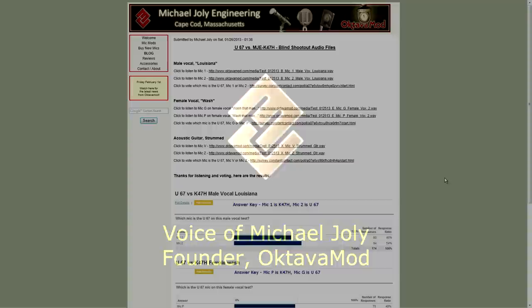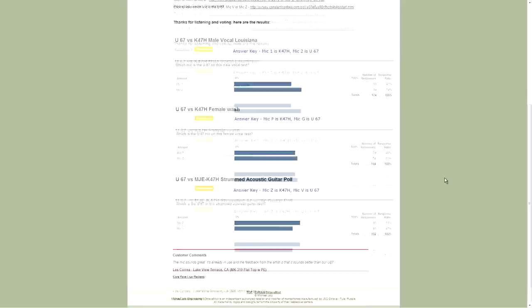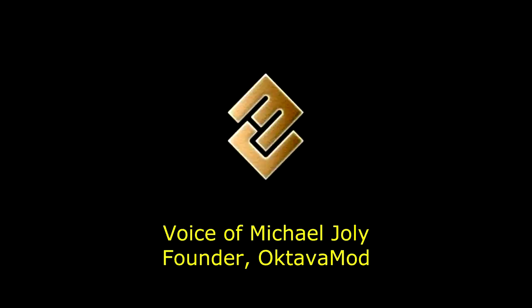So this K47H was sort of an accidental emulation of the U67 sound — without a tube though. I've got samples on a blog page on my site comparing the K47H with the U67. On first listen the overall timbre balance of the two mics is quite similar. But if you focus on dynamics, you can hear the U67 has a bit of compression going on — a combination of the tube, transformer, and negative feedback circuit. The U67 sounds a bit more processed, more radio-ready right out of the mic. My K47H is a FET and transformerless mic, so it doesn't have that dynamics compression you get with the tube-transformer circuit.